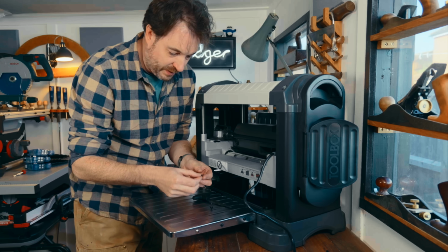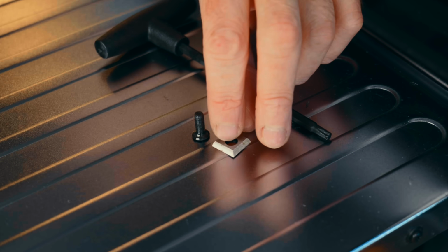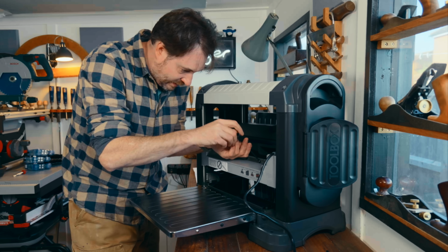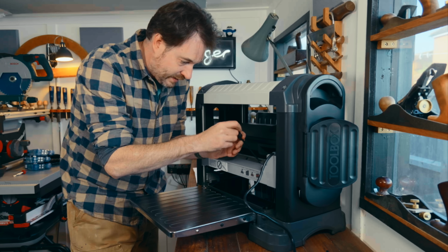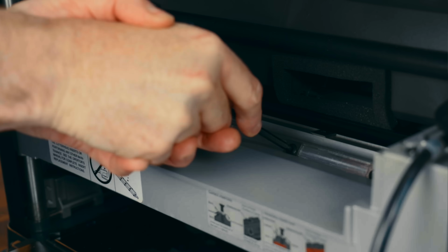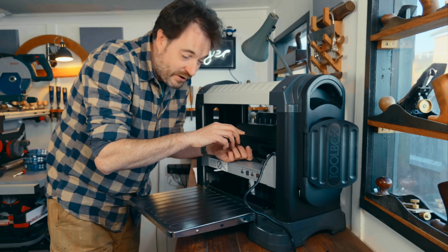So we have a little double-edged cutter, which means when I need to replace them, well, I can just turn it 90 degrees and get a fresh edge. Or if I ever need to replace a blade, I can just change one of the cutters if there's a chip out of it. And no more having to set blades. These just go in and set themselves. I can't believe how happy that makes me. I hate setting thicknesser knives.